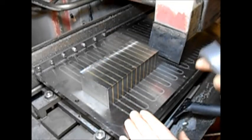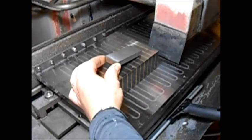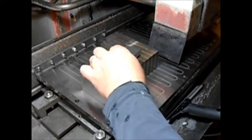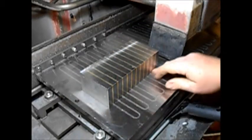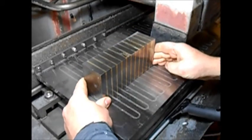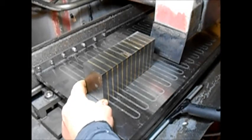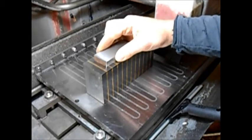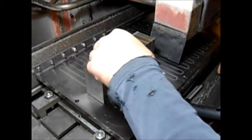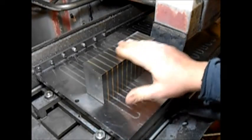Chuck off. Any residual magnetism is obviously still in there, just like it is with a normal chuck. It should be nicely held on there — I'm pretty happy with that. The thicker your block is, the more magnetism you'll lose. So if I was to stand this up on edge and use it, there's not as much clamping force up there. I can move that. It's still quite good, but unless you really had to, obviously avoid using something so high.